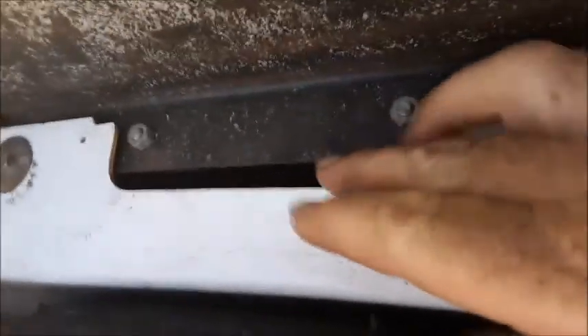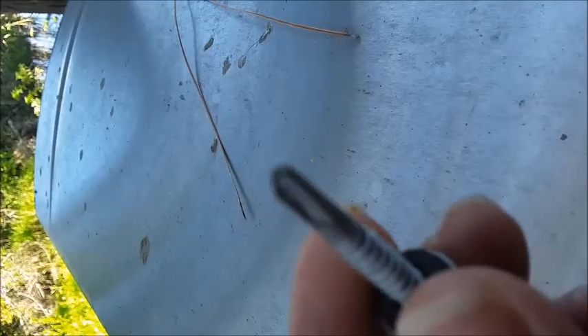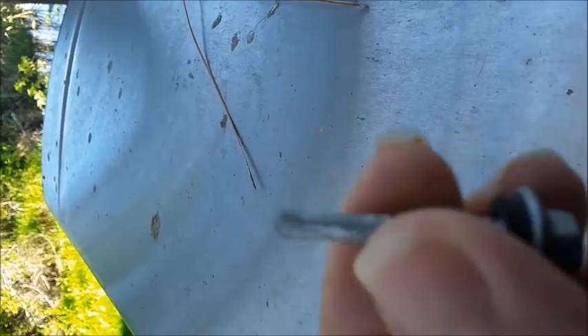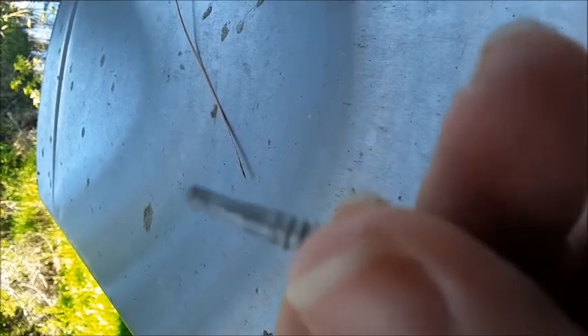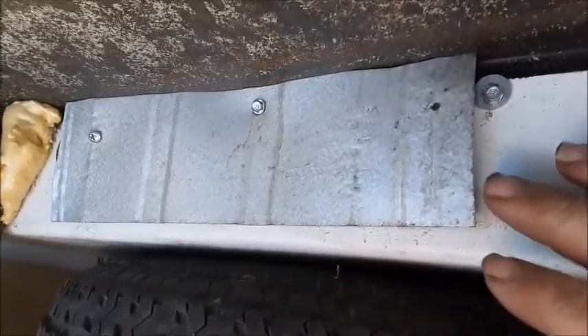Here's a factory gap that I can stick my finger through, and on this one I'm just going to screw a piece of metal right over the top of it. Here's an example of a self-tapping screw — it actually has a drill bit on the end, and when you screw it in with your drill gun it'll drill right through the metal and then start threading. Right here, I need to come back and put some spray foam on that one to make sure that mice don't get in.